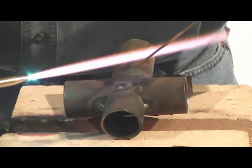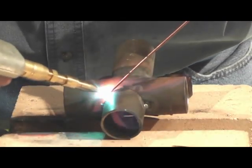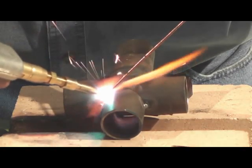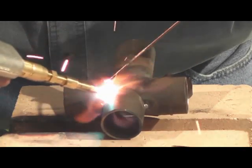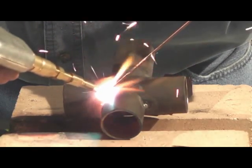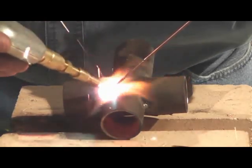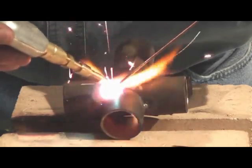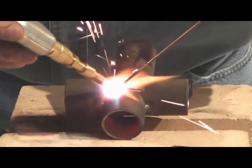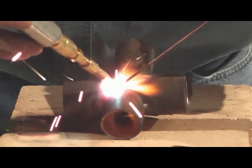All right, now what we're going to do — we've already got it tacked up. You would go in and tack it up real well. I'm just going to show you a small weld. Take that cone down, get it where it's molten. Now right here on that chromoly tubing, I have a tendency to do a little bit more of a circular motion, because you want to make sure that you get both of those pieces tied together. You can see how nice it actually controls that flame — that flame being soft and concentrated, you have absolute total control.